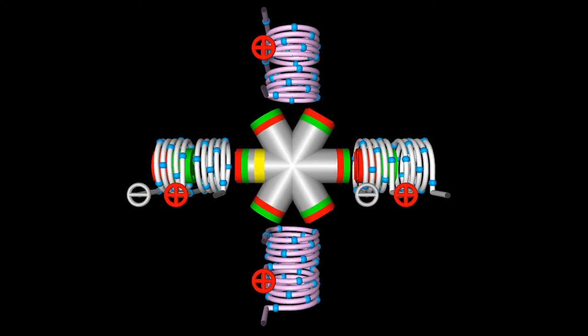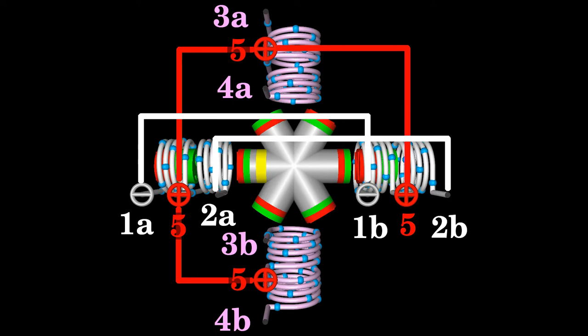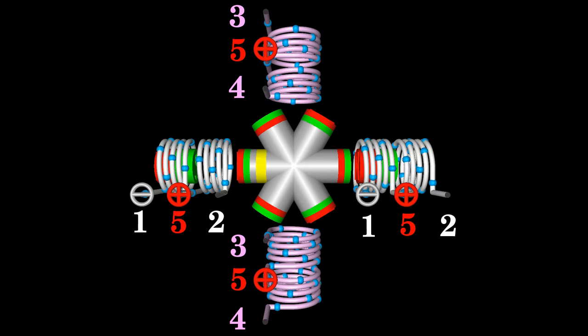In the motor shown here, each winding of the electromagnets has a center tap. All center taps are joined and connected to the positive terminal of the supply voltage. The white marked electromagnets are grouped to a phase — the wire end at terminal 1A is joined to 1B, as well as 2A to 2B. Same is true for the magenta colored electromagnets: terminals 3A and 3B as well as 4A and 4B are also joined. In total, we get 5 terminals coming out of the motor.